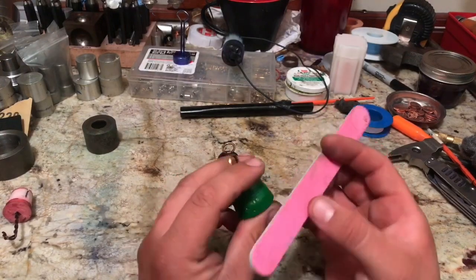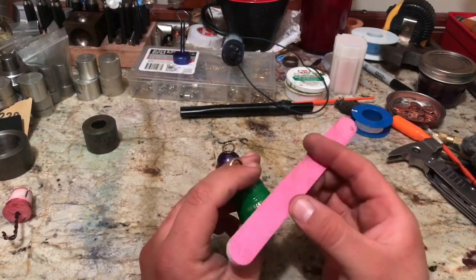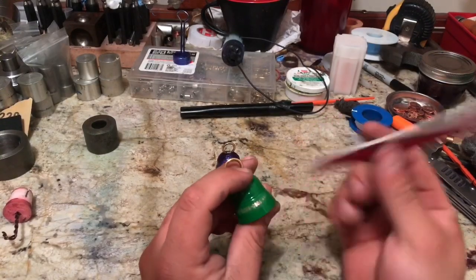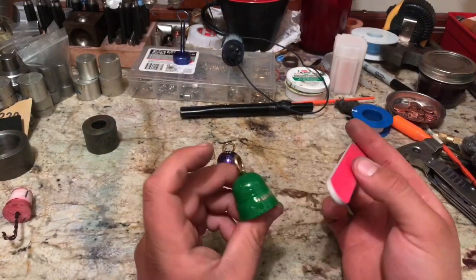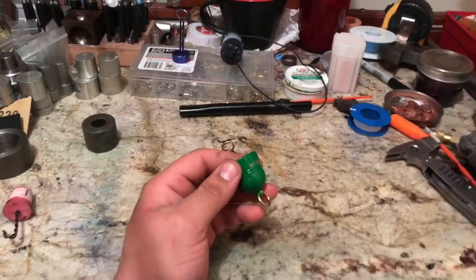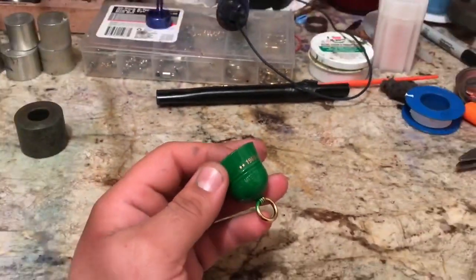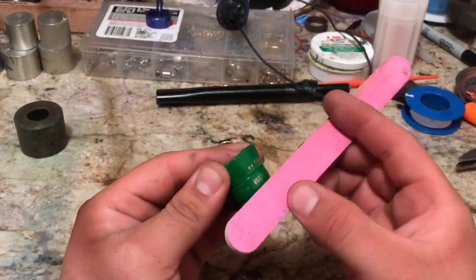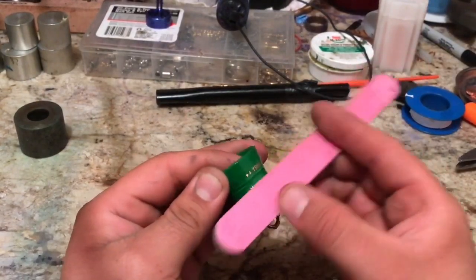They're very little expense. Once you sand the details out, what I like to do is also put it back in the oven and get all the powder to flow again. That way it gets rid of the little scratches on the powder coat. And then I'll pull it back out, and I'll put an additional coat of clear powder coat on top of it to protect it all. And then I'll put it in for the final cure.